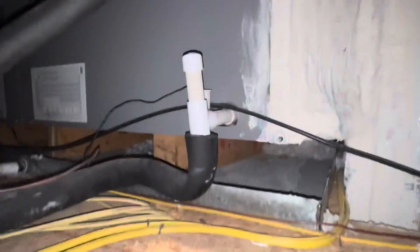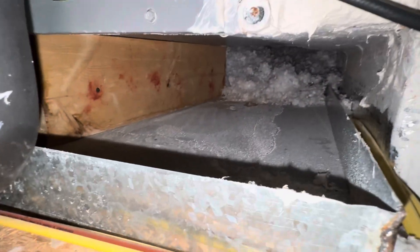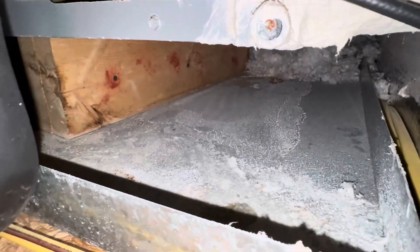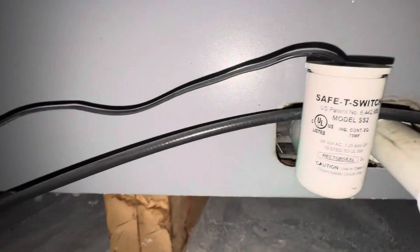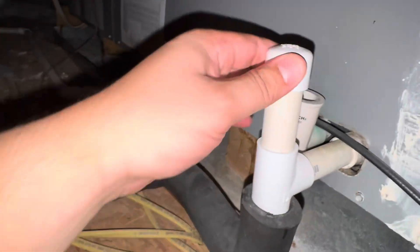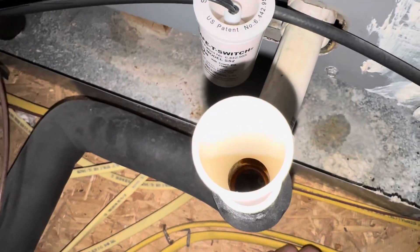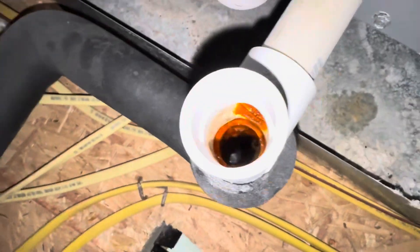Let me take you up to the attic because it's up here. Here's the drain line — I don't have any water up here, looks like I have had some but it's dried up. Nothing abnormal. This is the drain line right here and I have my E-switch — hear that? Looks like it just kicked on, so it's trying to drain the water. Double check in there just to make sure it is clogged or not.